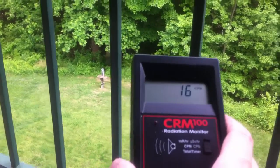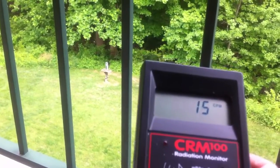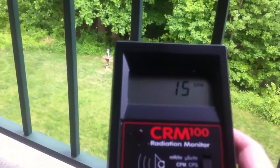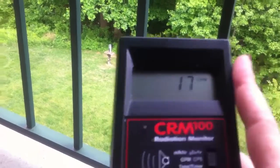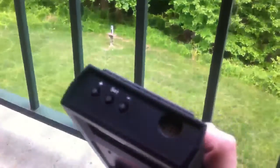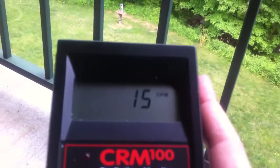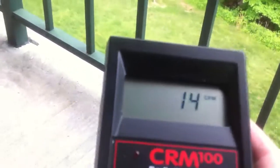If you were in Denver, Colorado, for example, you could expect to see 60 to 70 ticks per minute without any problem. A tick — a click if you like — is when a radioactive particle or piece of energy flows through the Geiger tube, which is right in here. That's a Geiger-Müller tube. When it goes through, it ionizes the gas, and that completes a circuit, which makes a little click noise. That's all it is.